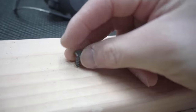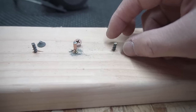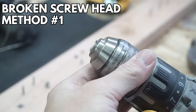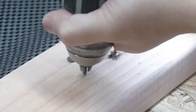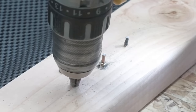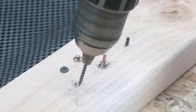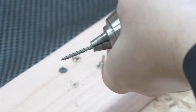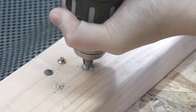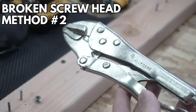Now we're working with broken screw heads. Here I have a drywall screw head and a general purpose screw head, both broken. Method one: instead of putting a drill bit in the chuck, just feed the chuck right through that broken screw head — notice how nice and tight it grips. Then gently go in reverse counterclockwise and it will take that screw out. I took out the drywall screw successfully, but testing it on the longer, harder general purpose screw, it doesn't work — it just works on certain types of screws.